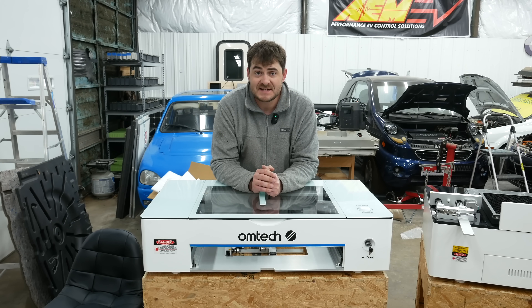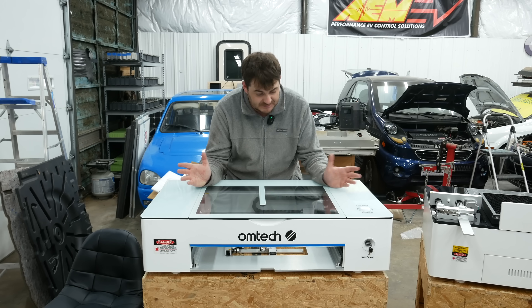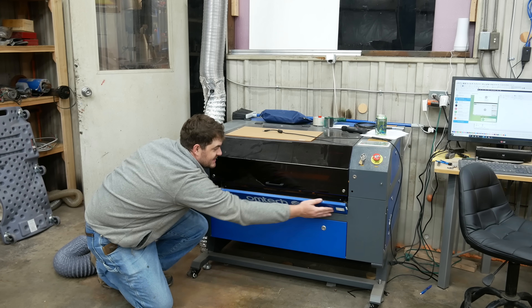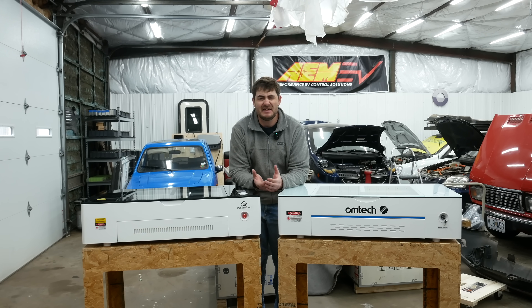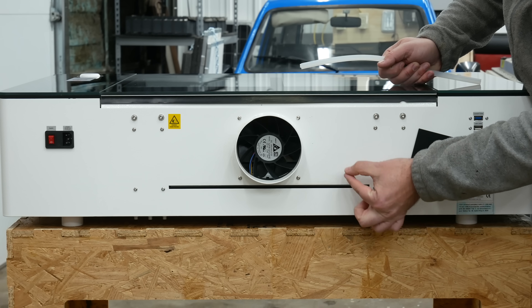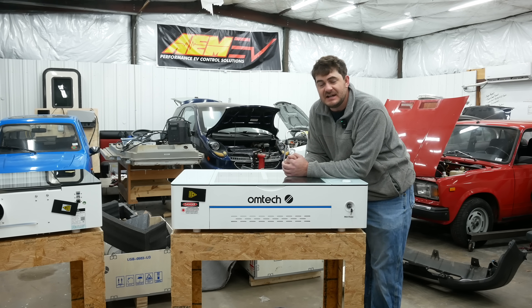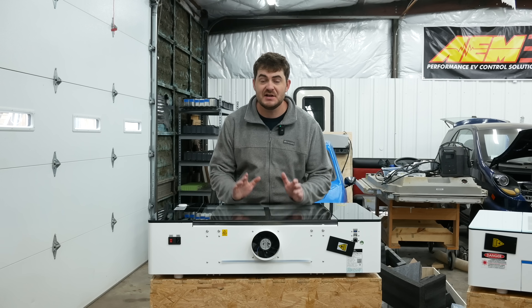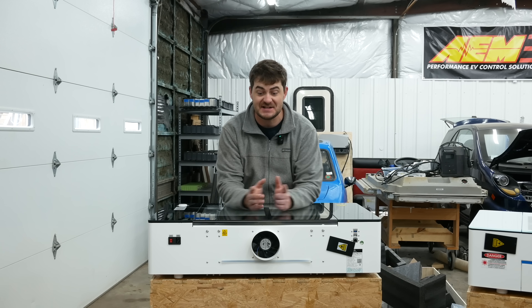I still don't know how to set the focus when using the rotary axis. That stupid formula references the machine bed, so without the machine bed in place, what do you do? For a workpiece larger than the machine bed, my cabinet laser has a door in the front that flips down so you can stick a piece out the front. These two also have a pass-through slot in the back — this is it. It's got a little piece of rubber acting as the door. It's not the full width of the machine bed — it's only a quarter-inch tall and it's at the back of the machine. Why make this so needlessly inconvenient? If someone needs a pass-through, they're not going to go to the back; they're just going to take the drawer out and operate it open. I should note that a Glowforge Pro also has an equally useless pass-through slot, but at least it's on the front and it's the full width of the machine bed — and a Glowforge Pro is $7,000.